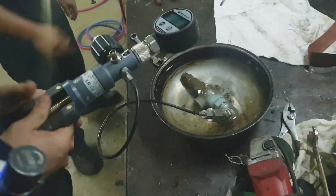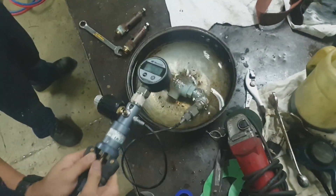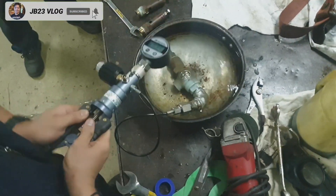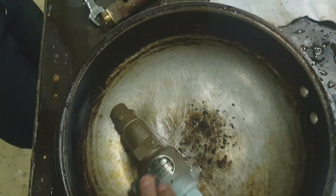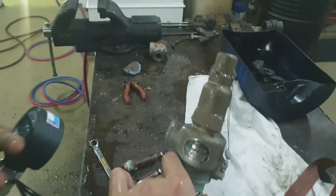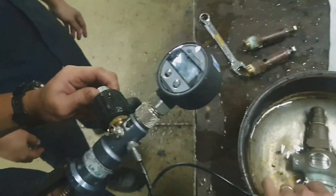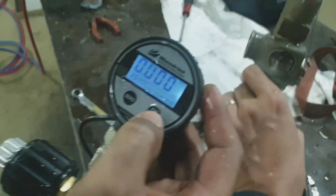Just for safety reasons, we have to test the valves first. Watch how this valve operates using a hand pump — the pressure calibrator. That's the opening pressure of the safety valve: 26.5 bar, or 2.65 megapascal. We are sure that this valve has opened at 26.5 bar.